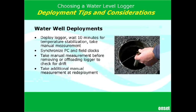When you make that deployment, you're going to make a reference measurement at the beginning, and if you make one also at the end it's very handy to check whether you had drift — whether the sensor drifted or your cable changed length, or maybe somebody with access to the well didn't put it back the same way. You'd be able to do a quick error check of your data with reference measurements at the beginning and the end.